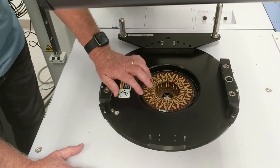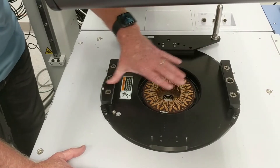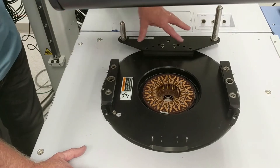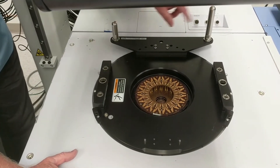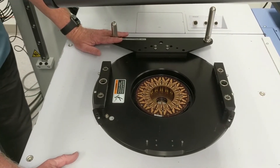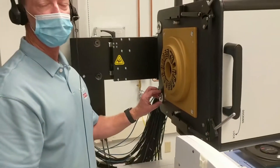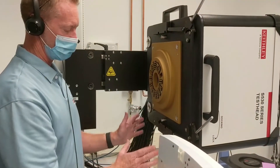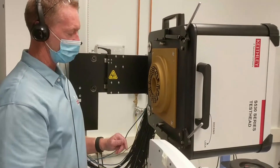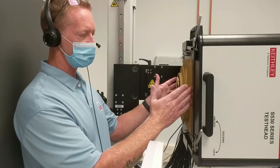This happens to be an S600 probe card, and the insert ring is the same insert ring that was used on the S600 — the same AIBs — because here are your fine alignment bushings. What we've added is a gross alignment section: two gross alignment pins. The shorter one on the left engages a lever inside which controls the interlock. The interlock is now built into the docking with no external wires — it's just internally on that pin.